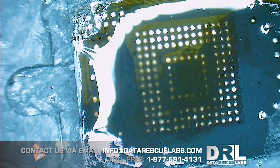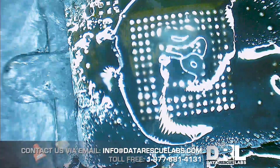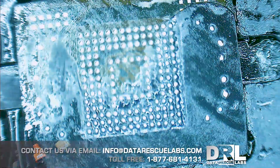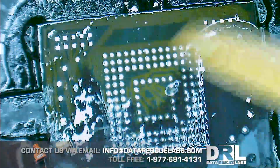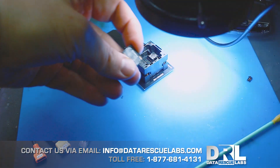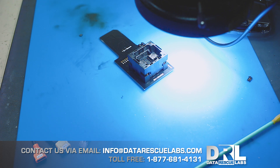The next step is to clean it. The cleaning process takes a bit of effort — I'm trying to keep the temperature of the soldering iron as low as possible, just enough to melt the solder. You can see it's cleaned up halfway. I want to see if it reads at this point rather than going further, to really limit the heat exposure. Here's the chip cleaned up — I'm going to put it in a reader.